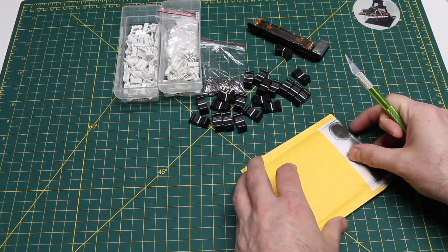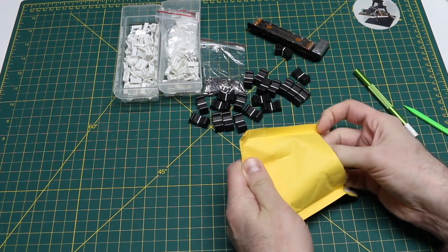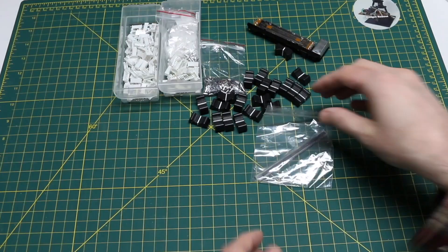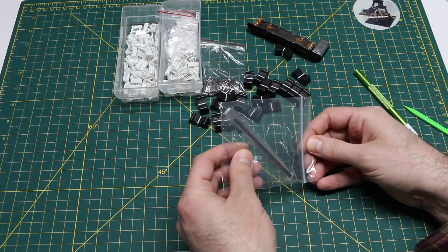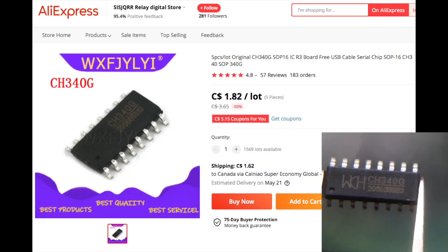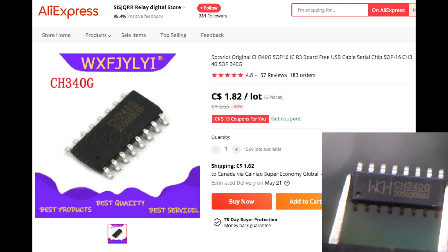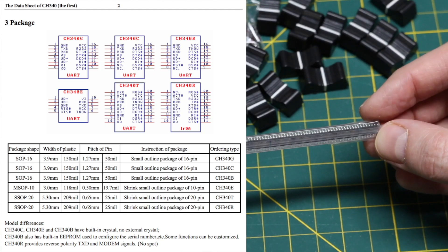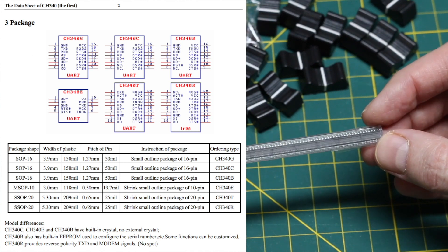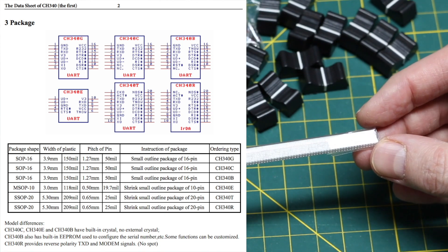This package is not in English so I can't read it, and there's something in a tube — some sort of surface mount IC. Using the magnifier: CH340G USB-to-UART. These are the ones with more pins, so it's not just transmit and receive — it has all the hardware flow control: DTR, DSR, clear to send, request to send.